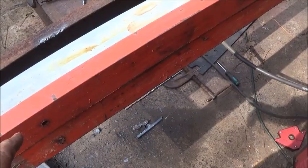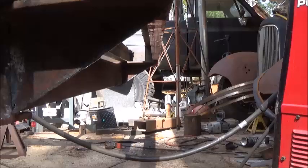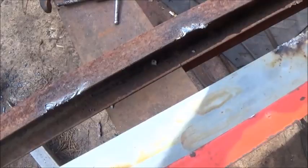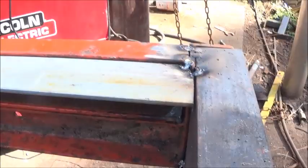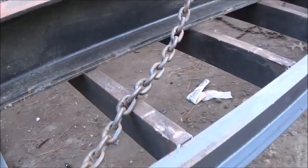I went to a full 20-foot 2 inches. Now I had to add to the back of that one to do that. So what I done, as you can see, was I cut the other end off, and then I just took this end and put it on here to make both of them wedged up. So that'll work. And then we added a cross member in close, and it'll get all welded in. And then we got a piece of angle on top right here, and our board actually slides up under that angle iron.